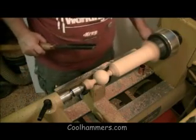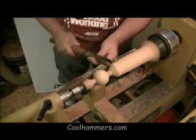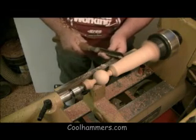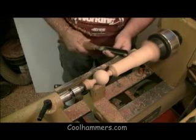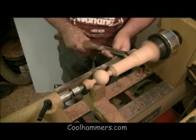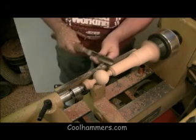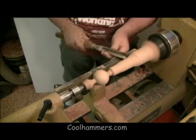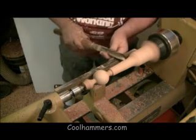From here, this is a pure spindle turning exercise. Go ahead and rough it on down. You can make the handle any length that suits you. Yeah, the dimensions are really arbitrary. I got a sphere here of around 2 inches or so in diameter, so my handle is probably going to be around 7 inches. You can make it as fancy as you want or as plain as you want. You can use wire burning techniques. You can just make it plain. It's really up to you. So sit back and enjoy.